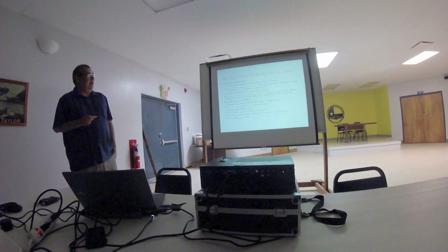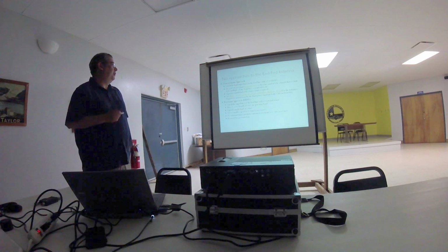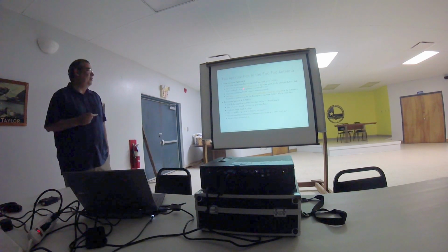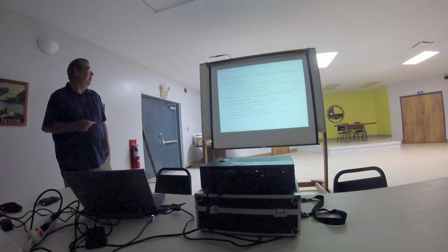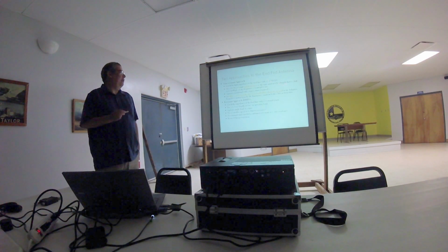So there's actually two types of end-fed antennas, okay? There's a non-resonant approach. And for the non-resonant approach, what we have to do is first match the high impedance of the feed line with a 9-to-1 unun. Essentially it's a 9-to-1 transformer here, and that's to bring that high impedance of the feed point down to a level that's manageable for the rig. But it's non-resonant, so it's very important that the length of wire you use is not a length that is a half-wave multiple of any frequency you tend to use.